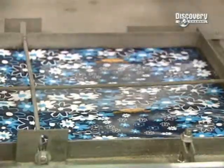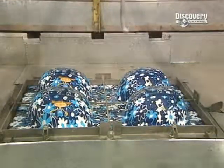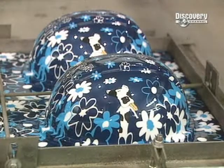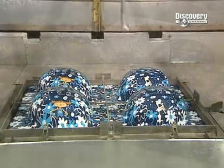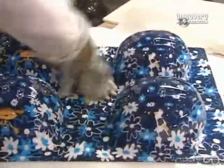Fabrication begins with the exterior shell. This polymer sheet is heated in a heat former at a temperature of 65 degrees centigrade. The sheet is suction fitted to fill all the cavities of the mould. This operation produces 4 shells. Then, when cooled down and hardened, the 4 shells are cut by hand.